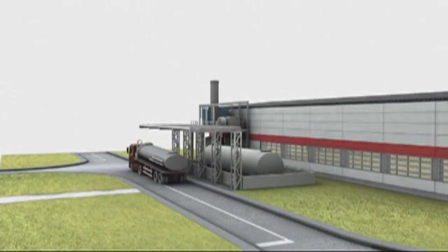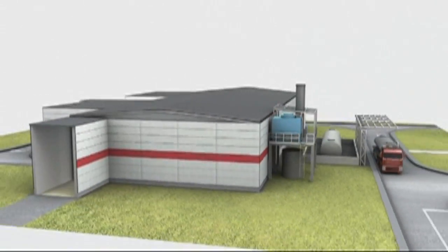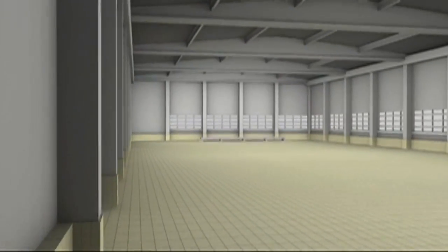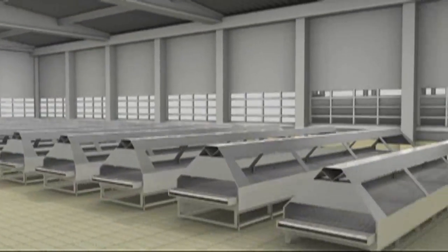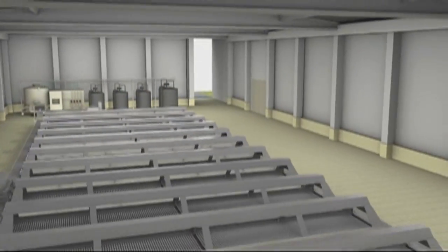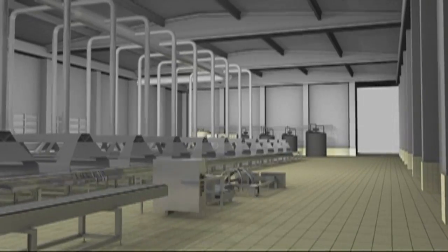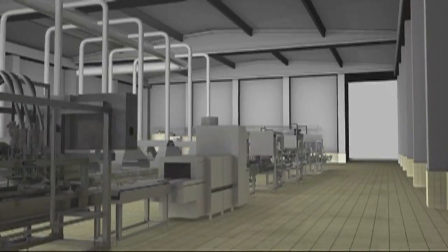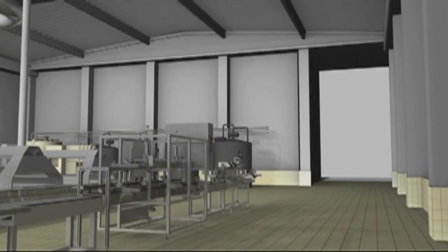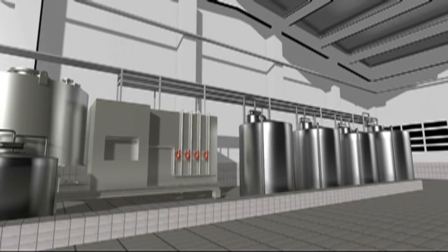Digatron warrants a more rapid, more flexible, and therefore more efficient integration of leading technology solutions. Utilizing our strong and experienced engineering team, we provide the required systems and facility integration — for instance, water cooling tanks, battery handling, and battery finishing machines including leveling, plug setting, washing, testing, brushing, greasing, hot marking, and finally labeling. The integration of water treatment, ventilation, and acid dilution systems completes the delivery volume for the turnkey formation plant.